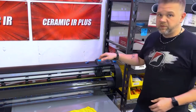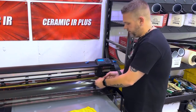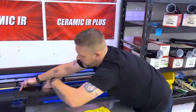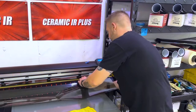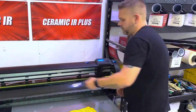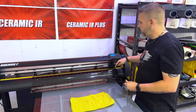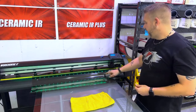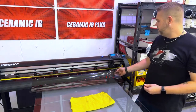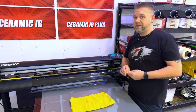The machine just got done cutting a strip along the entire cutting strip. Right off the rip, you can see I didn't change my force — it's still set at 66. We were cutting squares, and it really wasn't cutting through the liner. And right here it pierced through the liner. We'll go to this end — same thing, it pierced through the liner on that side as well. And it's tough to peel. So that tells me this blade is just getting worn out — it's piercing through when it starts the cut and when it stops. It's not doing very well.